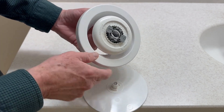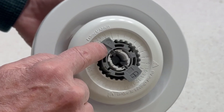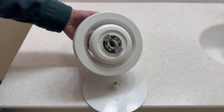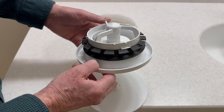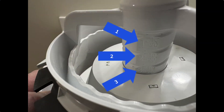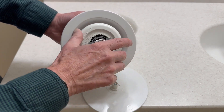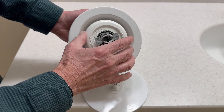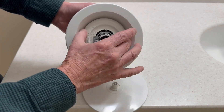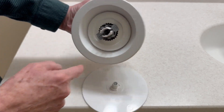Two things to notice. There's a scale on here from zero to 25. Right now my pointer is pointing at 25, so you might think that I have 25 levels of adjustment, but actually I have 75 levels of adjustment because on the back side there's another scale. It says one, two, three — so what that means is that if I start wide open at 25, I can go all the way down to zero and then pass zero, going again through another 25, and then down even more through another 25 all the way down to zero where it's not going to move anymore — this is pretty much completely closed.